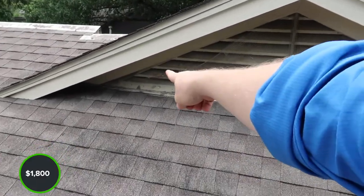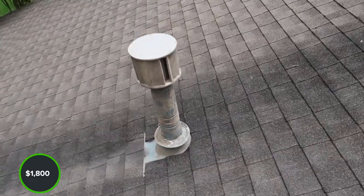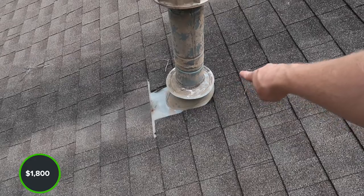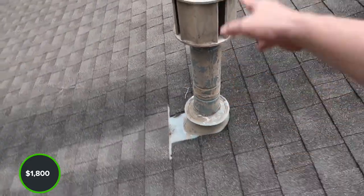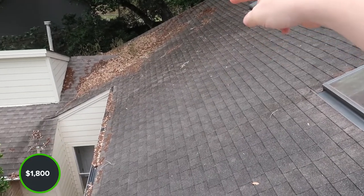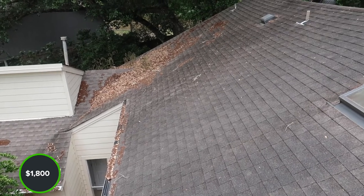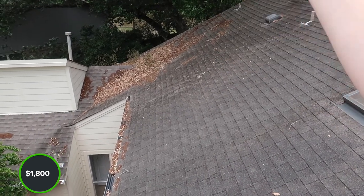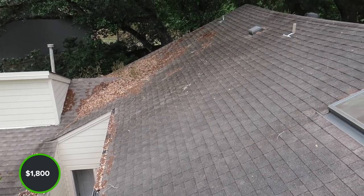You can see where the raccoon made it over here as well. And then just another flashing area — you want to redo our caulking bead right here, and also reseal the fasteners and repaint the flue. Doing another general scan, you can actually start to see some pitting right there. My guess is that the actual decking has become deteriorated, so we probably need a repair right there, but we're going to get in the attic and verify that.